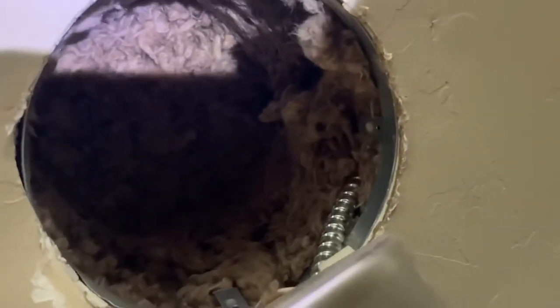But anyways, here's the can. There are the wires that we cut earlier, and it's got a piece of armored cable. They call it armor cable, or BX. Follow that, and that will take you to the ballast. And then the ballast has a little door on it. It has a clip, usually on the right side, and there's a tab on the left side, and the tab goes in a little slot. When you take the clip off the right side, the whole door to the ballast opens up, and you can work on the wiring in there. So I'm going to do that next here.